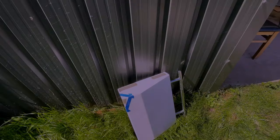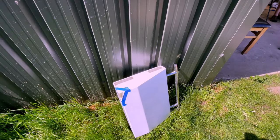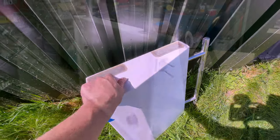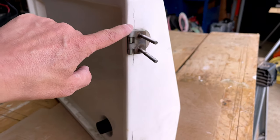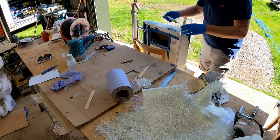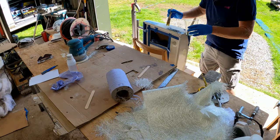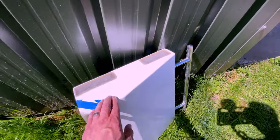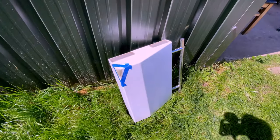Okay, so while I've been up on the boat just fairing the A-pillar, Richard has been working on this transom door where we'd got the crack and split on the hinges. So he's laid in some fiberglass over the weekend with some resin and some marine plywood reinforcement behind that. And then he's just come in and sanded it again and put a couple more layers on because it was just a little bit low. So I've left that out in the sun to dry.